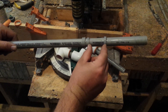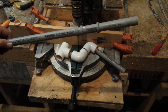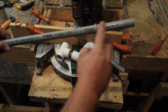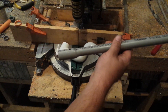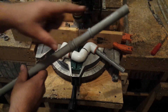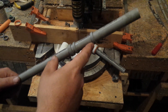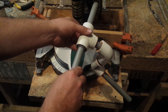I have the two inner rings and they're glued on at that 55.3 millimeter distance apart, and I also went ahead and put one outer ring on - make sure to leave this one off. I went ahead and put that one on because it's got a built-in for the bottom and you're gonna need that one anyway. So go ahead and get your three put on, leave that one off for now. We'll work with that later - you won't be able to glue this one on when it's threaded through making up those bearings.